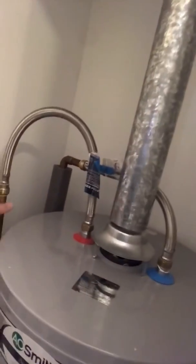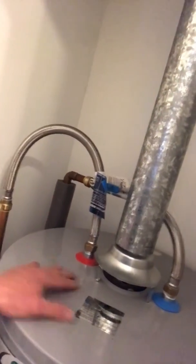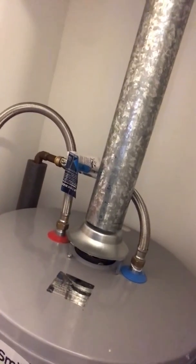Then we also are not bonded, so the tank has no electrical bonding to the water lines, the copper water lines. But the copper water lines are also compromised down below, and they're spliced. So there's different types of water lines throughout the house. The bonding is kind of what it is. We just always want to see that. So the bonding should jump between different conductive materials on that plumbing and get eventually to the electrical panel, which it's not. So we want to see that.